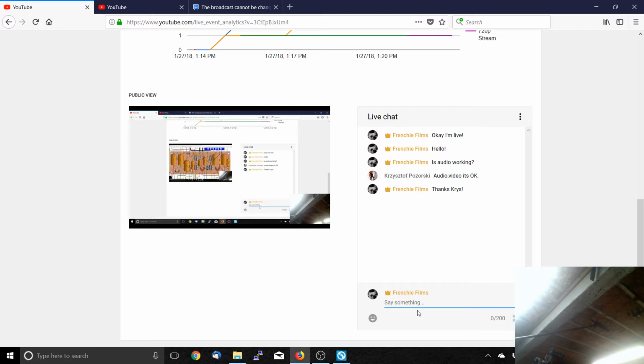One of the things that's been a bit of a bummer for me is almost all the caps that I'm finding don't have exactly 0.05. They have either 0.047 or 0.056, I think it is. And so I've kind of randomly chosen one or the other in those cases. They're only off by a little bit. I don't know how much it's going to affect the tone of the amp. If I feel later that there is a problem with the tone of the amp, I will possibly start changing some of those values as well.